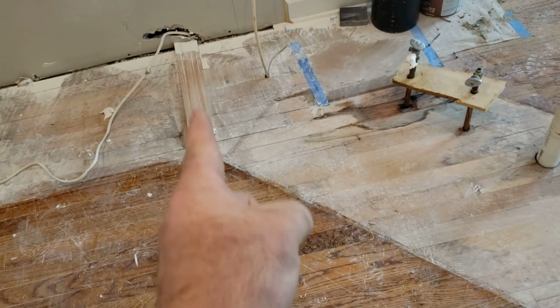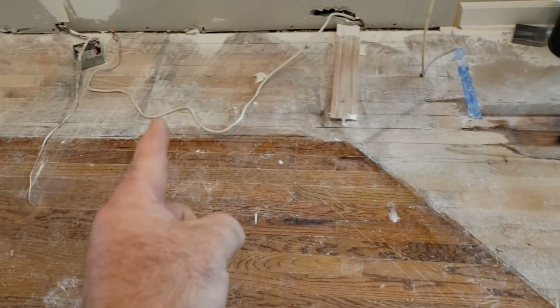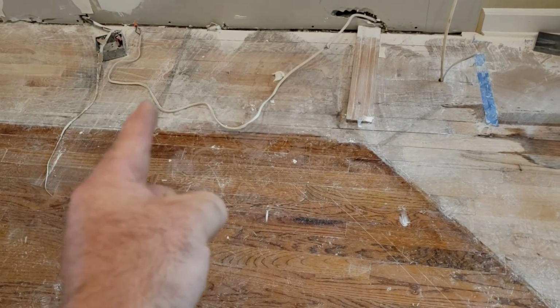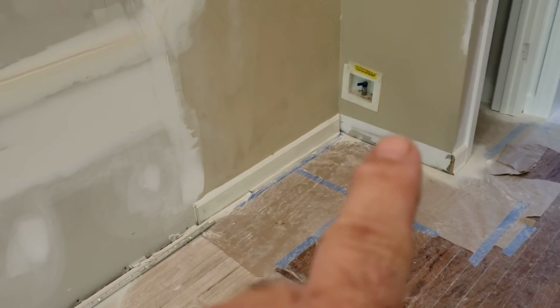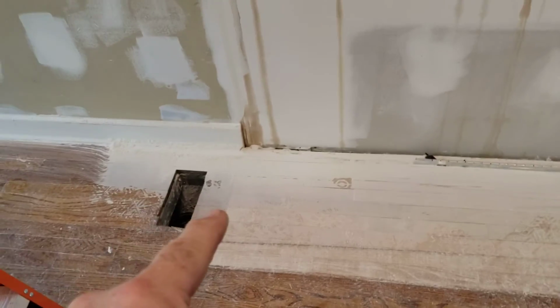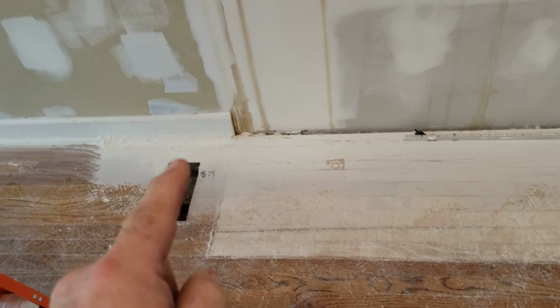That's what that block on the floor was, where they actually nailed an end panel, and then there's where your dishwasher was. And if you actually look, there was a small cabinet between the dishwasher and the stove. Enough for that side. This side over here, we are 120 inches from the corner of the room over here at the fridge all the way to the vent. So our 116 to 118 is our maximum length on our cabinets for this wall.